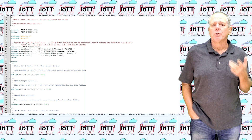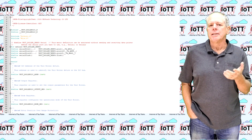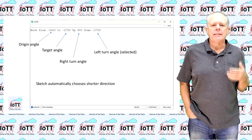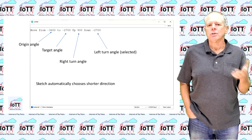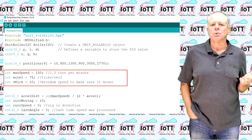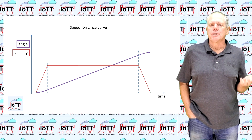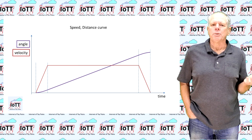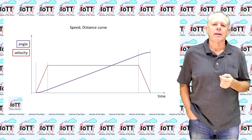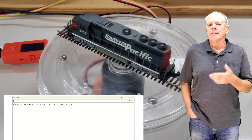M5Stack provides an Arduino library for the BLDC motor so creating a simple sketch to make it run was a piece of cake. Since I only wanted to do some tests, I only provided functionality to rotate the turntable to an angle that I can set using the monitor. The value is entered in tenths of a degree so the range runs from 1 to 3600 for a full circle. Furthermore, I can set the maximum speed and the acceleration value used for increasing and decreasing the speed. I wrote the sketch so that after entering the target position, it first decides in which direction it will turn, then accelerates to the top speed, maintains the speed until it reaches the brake point, then decelerates to arrive at the target position. The result of the calculation is shown on the monitor, showing the distance in both turning directions and indicating the target position.